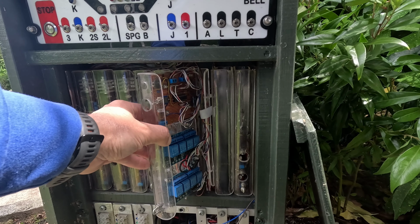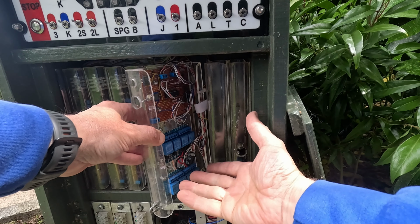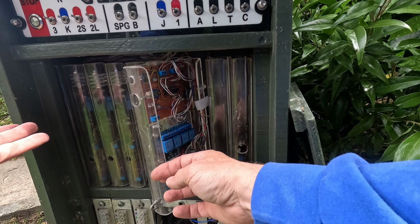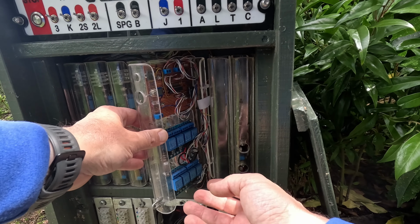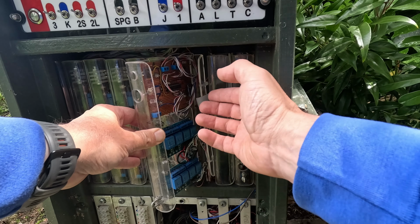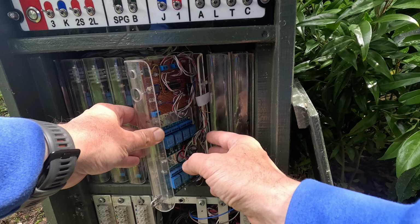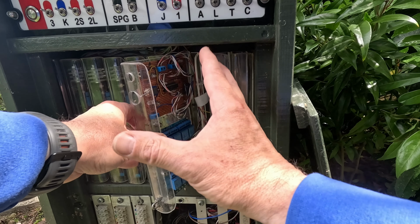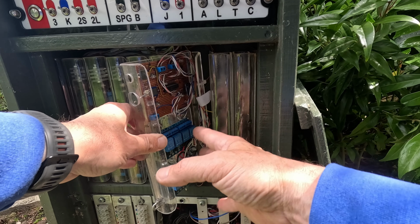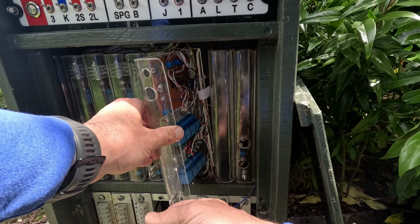Let's take a quick look at some of the circuitry that I'm working on for managing point movements. This is a point motor control module. In fact, it can cope with controlling 2 sets of points, ideal for this local situation where I've got the points on the output side of the station as well as the inbound. Another PIC chip, a smaller one, I think just an 18 pin rather than a larger 40 pin, and all sorts of control electronics and bits and pieces. That's very much under development. That module I've butchered and changed and evolved, and I've got 2 or 3 more development aspects to work on. I won't be using that this year, but it's there as I'm trialling it and developing it.